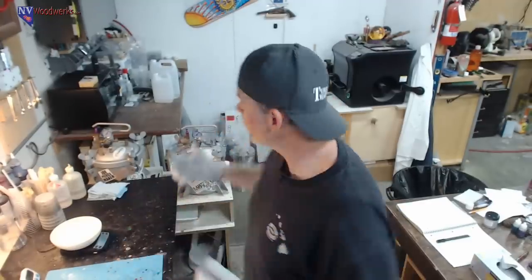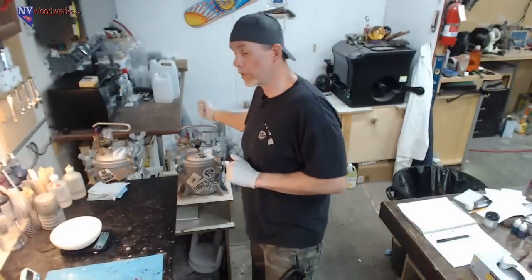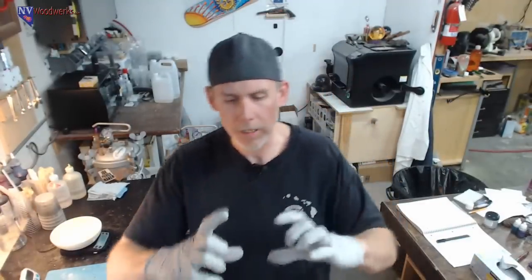It's not going to chemically bond to the first pour. It's a mechanical bond only at that point, and you need to scuff it up and give it some tooth to bite into. The reason I say to do it really quick is that you'll catch it while it's still in the initial stages of curing, and both of those layers will cure together. Within the first 24 hours, you shouldn't really need to scuff it up. You could if you want, but you really shouldn't need to.